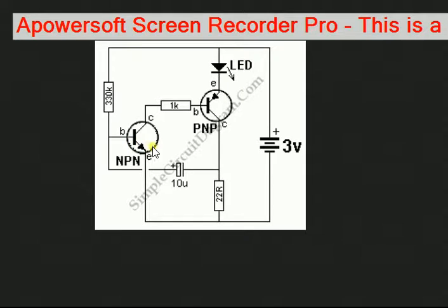Anyway, now what I did is took two of the circuit instead of just one. So I doubled everything. So I got two of this resistor here, two of that resistor, two of the LEDs, one NPN, one PNP, two of the capacitors, and two of these resistors. And what I was able to do was have it where you could test either kind depending on which way you connect your transistor.